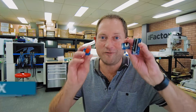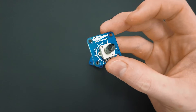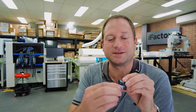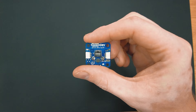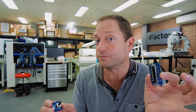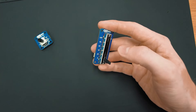A more experienced maker can basically come to this page and get everything they need out of it. I've been working on three new additions to the PicoDev range: the PicoDev Slider Potentiometer, the PicoDev Rotary Potentiometer, and the PicoDev Button. The Rotary Potentiometer is a smart module with an address selectable on the back using four DIP switches, which is a new addition to the smart module range. Before, we used a couple of DIP switches and solder jumpers, but now we've gone fully DIP switch — so no soldering or cutting required. Both potentiometers are addressable using I2C and will give you a number between zero and 100, along with some other scaling tricks you might use in your projects.